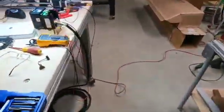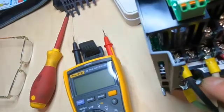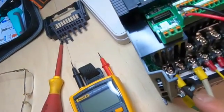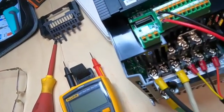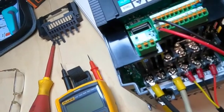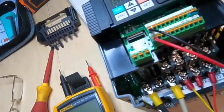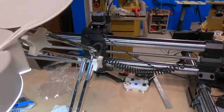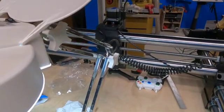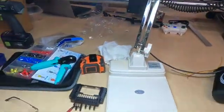Over the night I worked on connecting this. I found the right size eyelets, rated for 10 gauge, 10 AWG. If you do the math, 2200 watts supplied at 220 volts is 10 amps. And that's where I get the wire for the spindle — 18 gauge, rated for 3.5 amps, or a total of a little over 10 amps. So that should be good there.